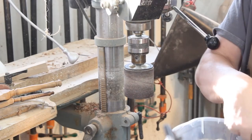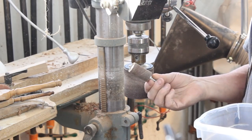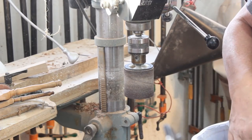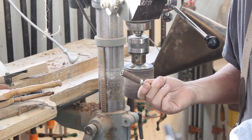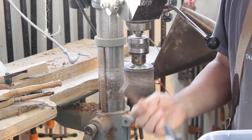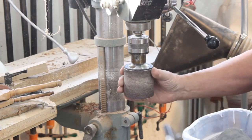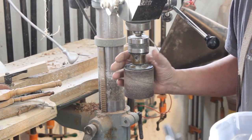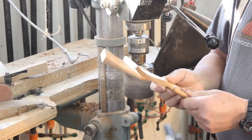They are marvelous. I've got different dimensions — very narrow small ones to fit different contours, and here's a very small one that's probably half an inch. If you're doing some sort of detail work or fret work, these are really cool to have. Here's a sleeve — you simply put a new sleeve on there. I'm not sure what grit that is, it could be 60 grit. Sometimes I use these as a carving technique.